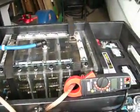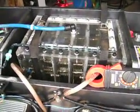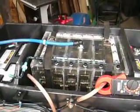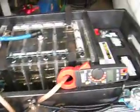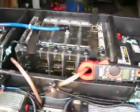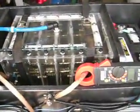Once you set this electrolyte, because it runs so cool, there's very little water vapor escaping this cell. So the depletion of your catalyst is going to happen at an extremely slow rate versus previous designs that ran pretty hot. After a couple hours, you're getting up to 90 degrees Celsius. A lot of your catalysts can get suspended in the water vapor droplets. Okay, this isn't happening with this cell. This puppy is super cool running, as I've kind of alluded to in some of my preliminary tests.